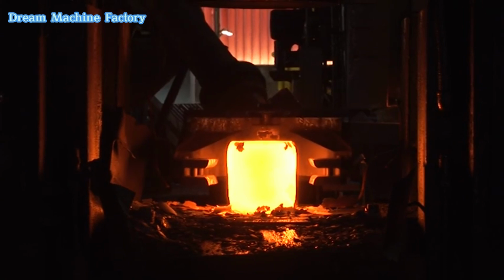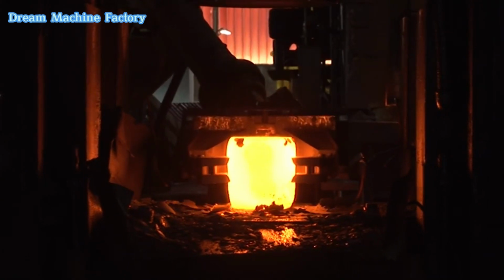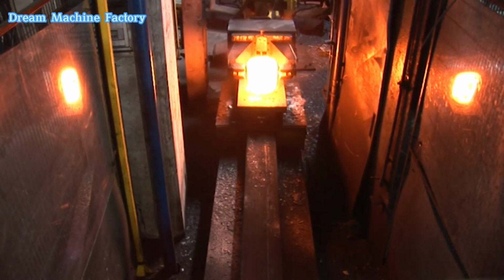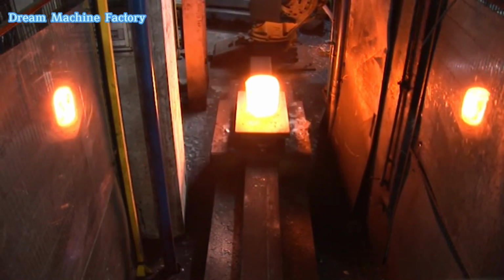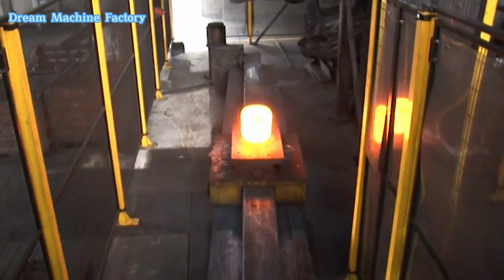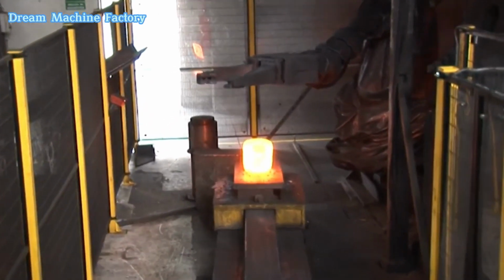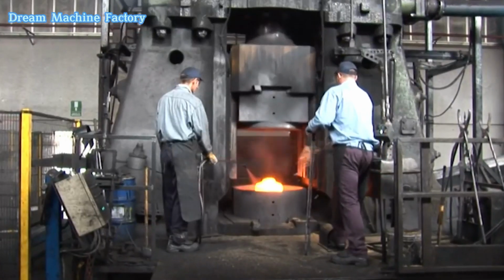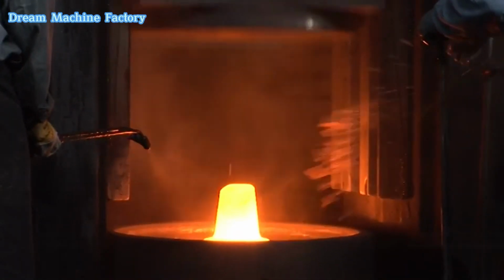and improving workplace safety. Once the forging is complete, the parts go through a trimming process to remove excess material, known as flash, using trimming presses. The trimmed components are then transported via conveyor belts to designated storage bins, ensuring efficient handling and organization.